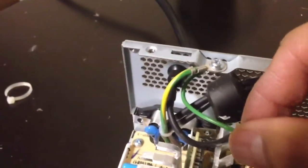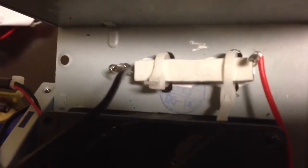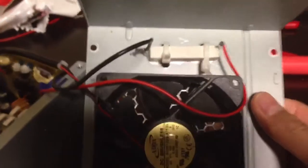So here are the voltages on each of the leads. I'm opening up the case — I've connected the five volt red lead to ground via a ten-watt, approximately ten or fifteen ohm resistor. The green is connected to the case so that the unit runs; it won't run if it's not connected. Here's the resistor putting a load on the five volt rail, which stabilizes and improves the output on the twelve volts. I've put thermal paste and connected this resistor to the casing so it keeps cool.